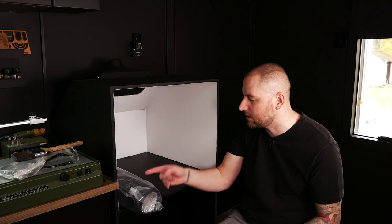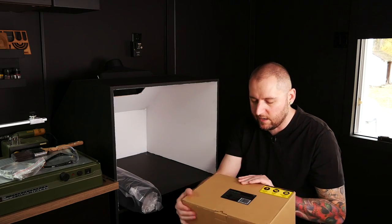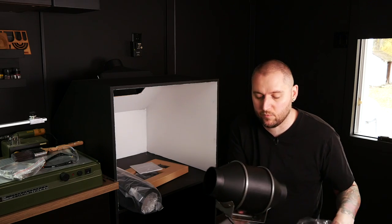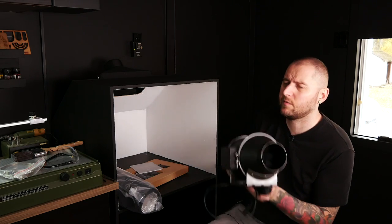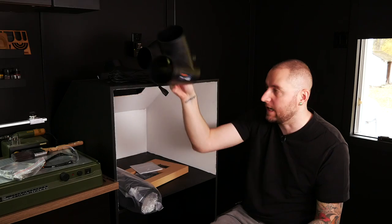But for now, that's not a problem because I'm just gonna skip it and just use the fan and the hose. Now this fan I got here is a pretty hefty fan. It is 205 CFM, which is fairly strong. Your typical bath fan is going to be less than half of that usually. A big bath fan is like 95 CFM, maybe 110 for a larger one. This is also an inline fan, and the reason I chose an inline fan rather than a bath fan or a hood range fan that would connect just to this is again so that I could use that one fan for multiple sources of extraction because I can divert it.